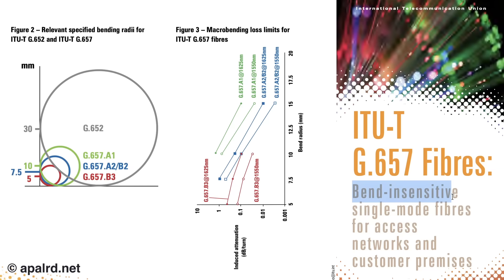This kit contains everything we need to get started. For those who like going really fast, I'm also going to explore how to run 10 gig over the same fiber. Since this is G657.B3 bend-insensitive single mode fiber, we can run anything we could run over normal single mode fiber, which can get up into the range of terabits if you want to spend a lot of money on your endpoints. For most people though, 10 gig or 25 gig is no problem over this fiber. The included electronics are for 1 gig, so if you need 1 gig, everything you need is in the box.